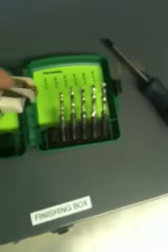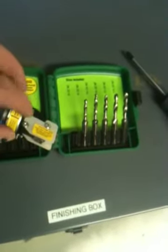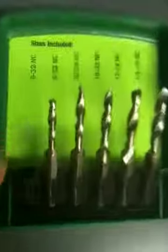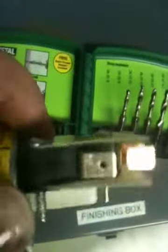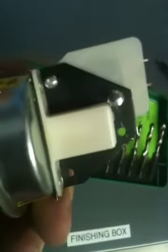What I had to do is take the switch part — the part that takes the electrical prongs — off of the new one, and thread these two screws here, which are from the light switch boxes. I believe that's a 6-32 on my tap and die set. So I took that off, drilled those holes a little bit bigger through the electrical part, then threaded it — put some threads onto there. I could use some nuts, but this worked pretty nicely, got it nice and tight, and threaded it onto that piece of metal on this diaphragm part, and hooked it back together again.